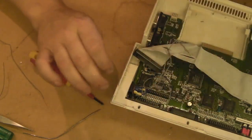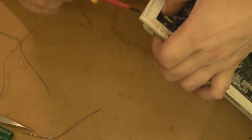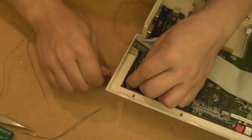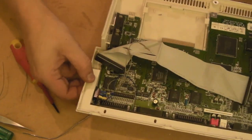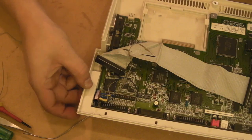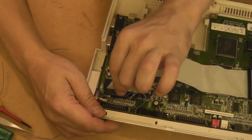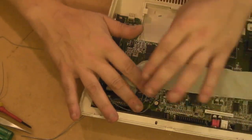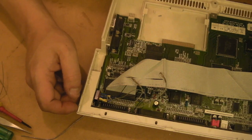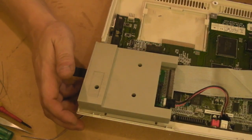First screw in — it's going to be a little bit tight around the disk drive connections where I've got the switch mounted, but there's enough room. It's just going to be a bit cosy. And that's the switch screwed into position — quite happy with that. We need to get that floppy connector back on there and basically that's the switch mounted. We need to reinstate the GoTek in there — I won't bore you with putting the GoTek back in, but that's essentially the full modification complete.